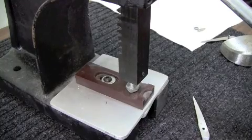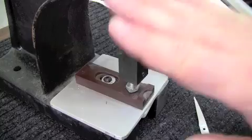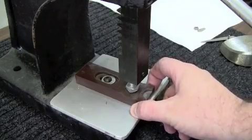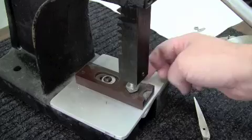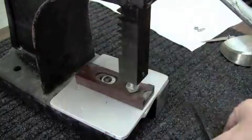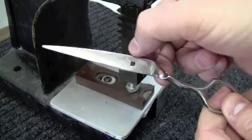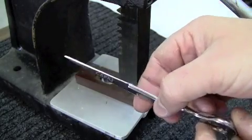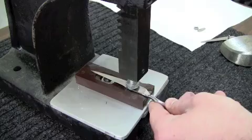Next I'm going to give this a shot with the Wolf one-ton scissor press system. This is a Dayton press, and this is the piece that Wolf actually makes that goes on the Dayton one-ton press, along with the pin that you can put into the ram bar. What's interesting about this is it's got a slight curve to it, which allows you to put pressure down on the shear to do a bend. Now on this particular shear, because it's hollow ground, this is not something I typically would do — there's a good chance I'm going to ding the inside surface somewhat. I'm going to go real light and see if I can move it.